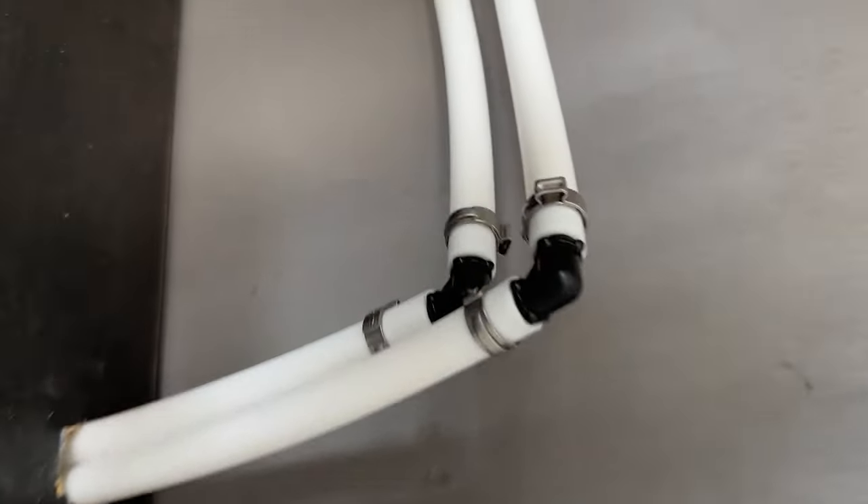Standalone sinks do not require a counter — they stand alone and come with their own legs. The pros: easier to install, they have integrated drain boards, and you can often find them used on Craigslist. Some cons are that the legs are often not tall enough to fit a gray tank underneath, so you might need leg extensions. When you go to buckle these down, you need to find a stud. As a pro tip, tighten your faucet hoses that feed your hot and cold water supply before buckling everything down, because once you do, it's hard to get your hand up in there to tighten things.